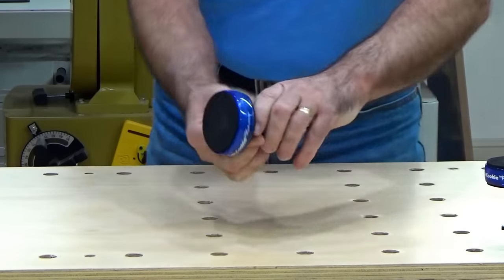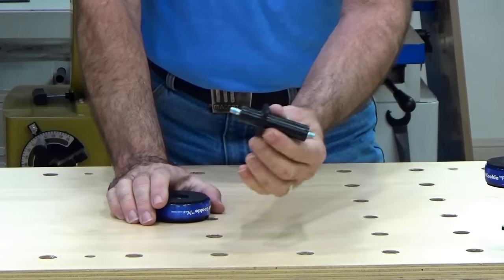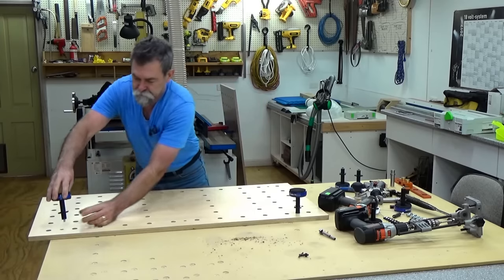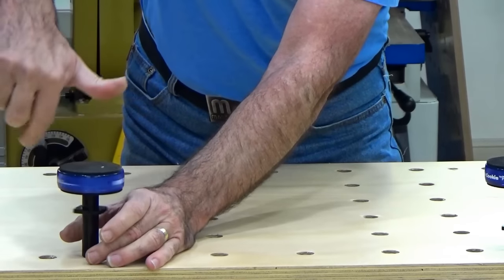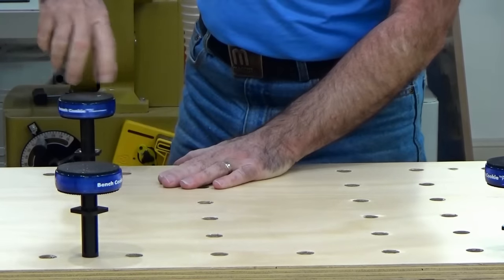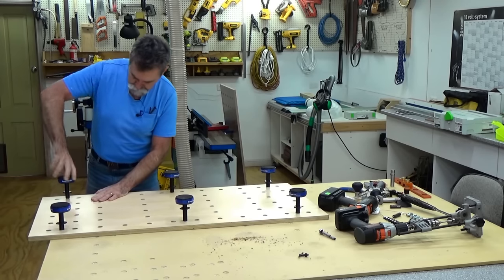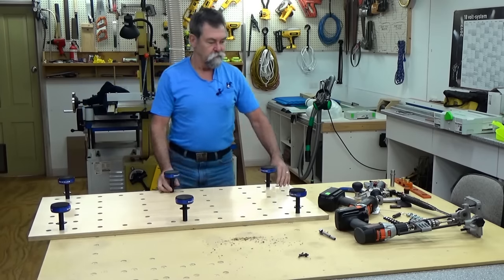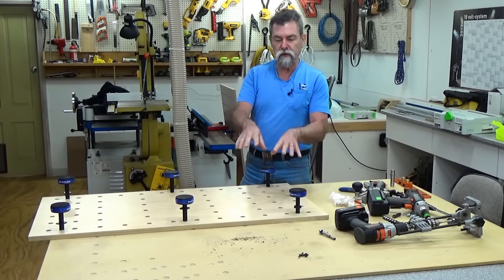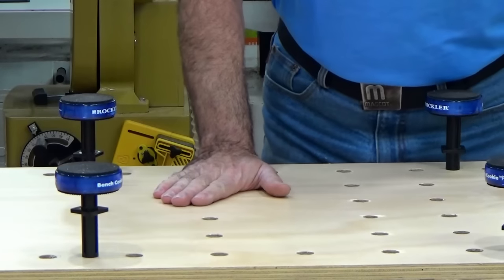These legs are bench cookies. A bench cookie does not slide — it won't slip. These are risers that screw straight into them. They normally come in packs of four if you're interested in getting them. I'll see if I can put a link in the description box for you. Now the only reason I've got my backing board here at the moment is because when you're drilling through plywood or MDF it's always good to have a backing board there so you don't get as much tear out — very little. This is the underside of my board and there's minimal tear out — it's come up really well.